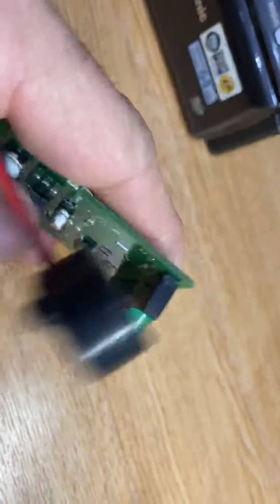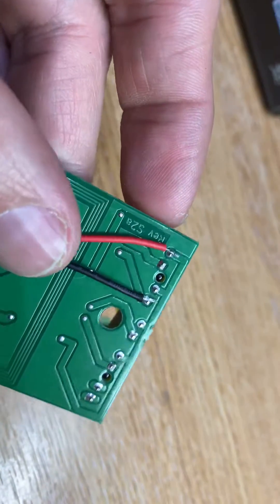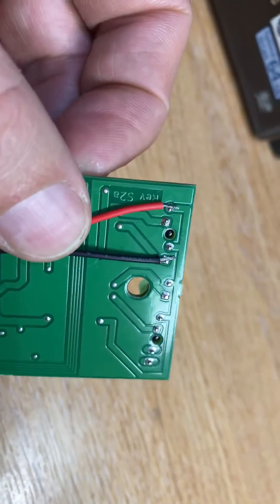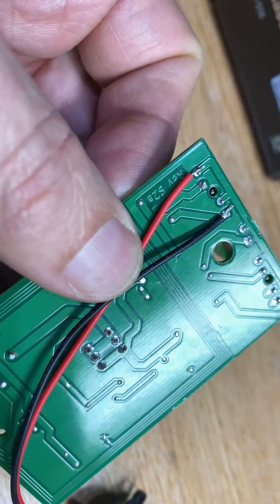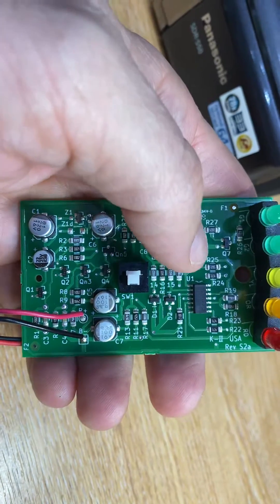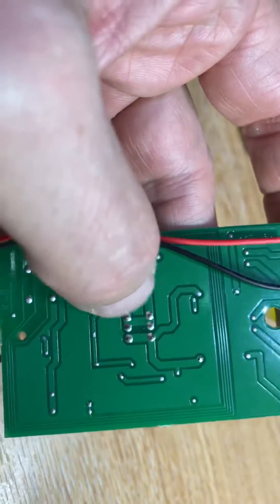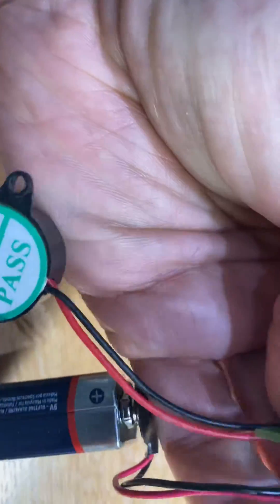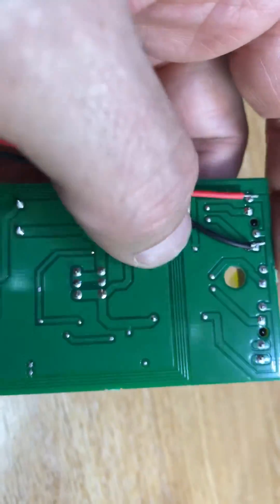These are the latest K2 boards, so all of InfraReady's K2s will now be 2020 stock. We've gone into the new decade with a new revision board, the S2A. Basically, I've now got more SMT surface-mount devices on the boards, removing the pin through-hole leaving only the switch and the LEDs. At the bottom there are a couple of power pins, and the rest of the solder joints on the back are just via holes.